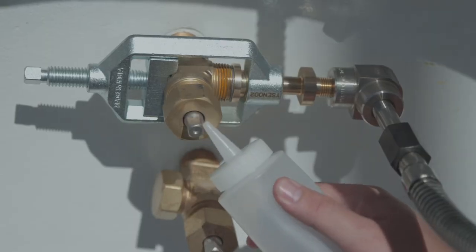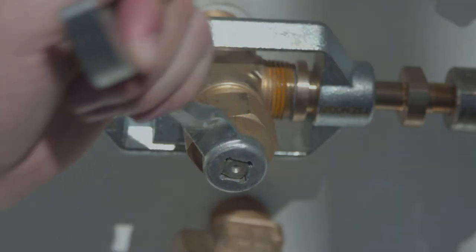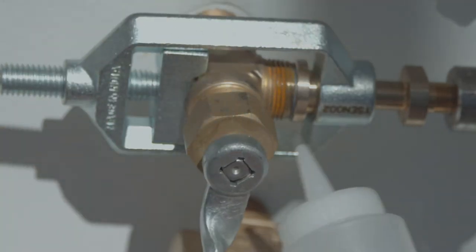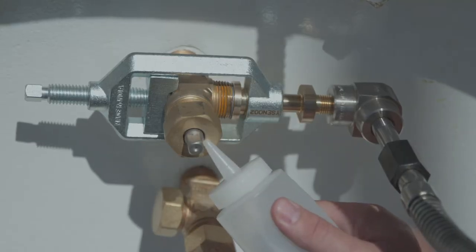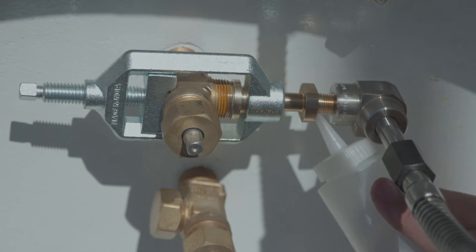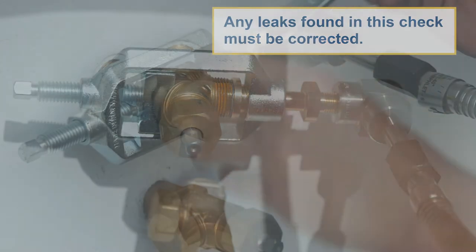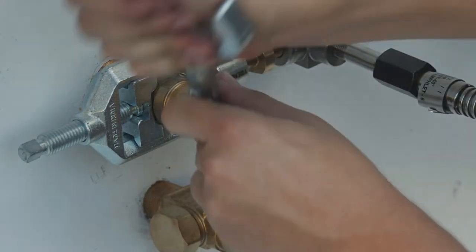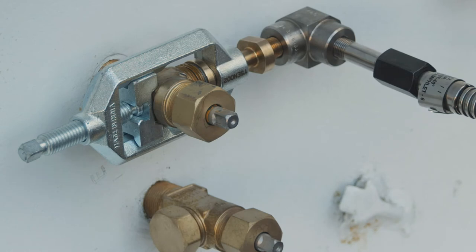While holding an ammonia wick next to the yoke connection, use the ton wrench to slightly open the top of the interior gas supply valve and then immediately re-close it. Use the ammonia wick to test the entire interior supply line, fittings, and connections for leaks. Any leaks found in this check must be corrected. Only after confirming there are no leaks, open the interior gas supply valve one full turn.